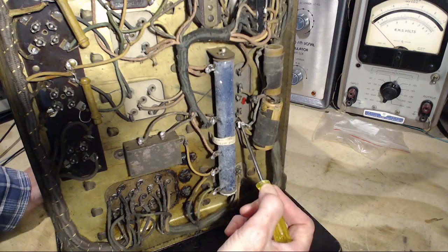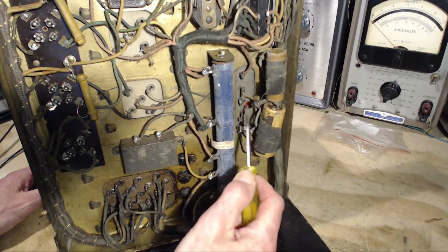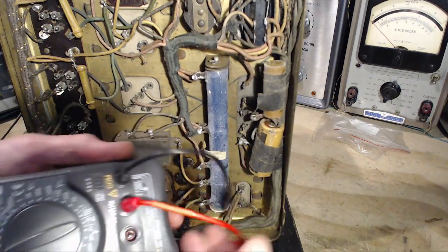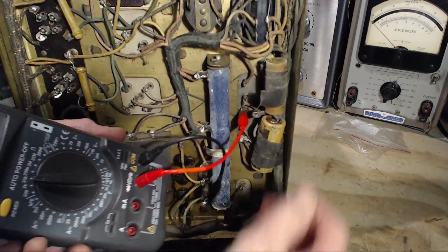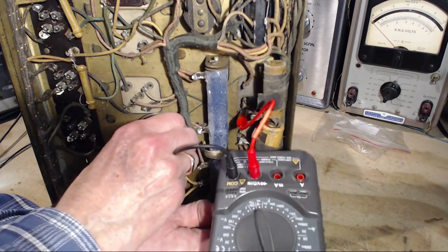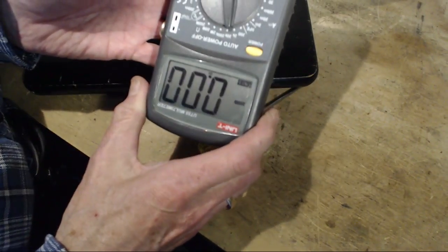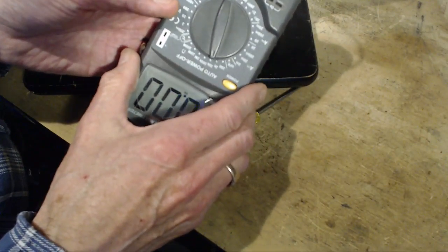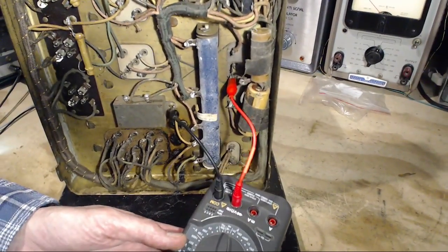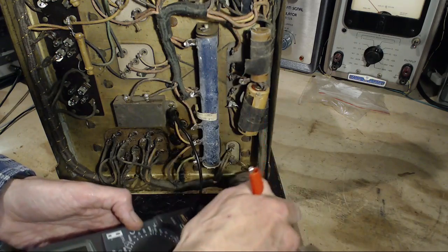Well, in the picture, this terminal will be what it is in the picture. Pictorially, it's correct. So maybe we can identify what each of these terminals is doing. This one, that one. Yeah, what about that one? Good, nice ground point. Here's one. So my question is, so that reads 0. It's upside down, eh? That reads 0. So I think this connection point, the one I'm pointing to with my finger, the one that's clipped on here, that's making it back to ground.